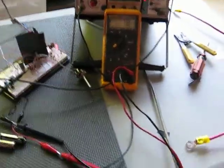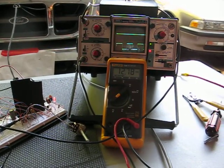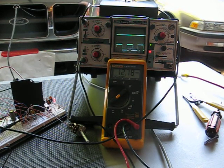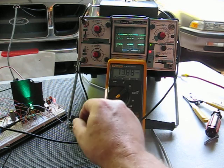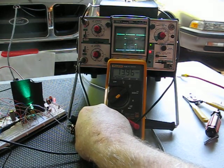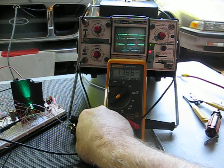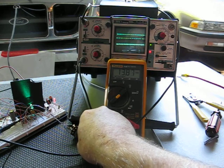I'm going to demonstrate the unit now. I'll start the vehicle — you should see this LED go on when I start it. The vehicle is now running and the green LED is on. I'm adjusting the PWM; the signal on top of the scope is the output going into the circuit. There it is — almost full on PWM, now full on PWM.